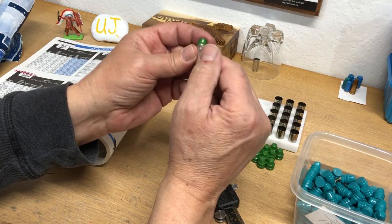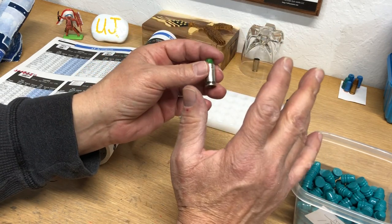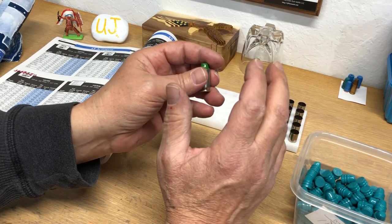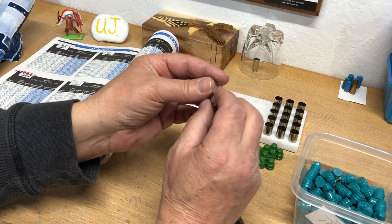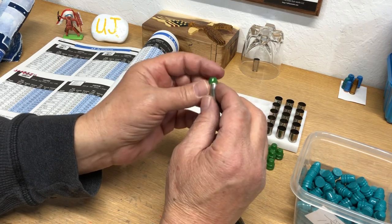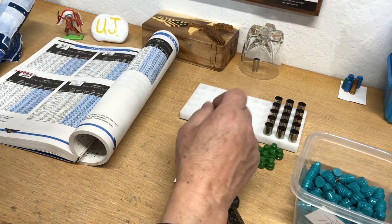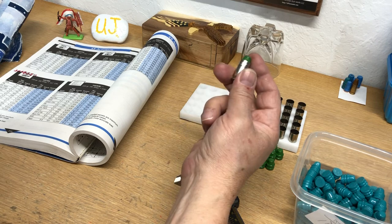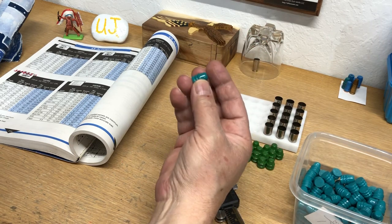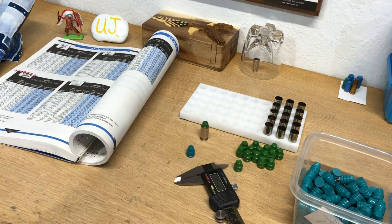In some calibers you might look at the primer pockets, but by then it's too late. You almost have to go by the diameter of your brass — is it expanding, is it doing weird stuff? There are a lot of factors. Always start on the low side. Don't trust your manual on overall length. I have two bullets here made by Lyman, from Lyman molds, that are totally off on their overall length and can cause you a lot of issues.